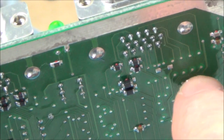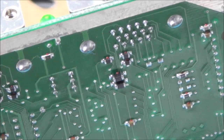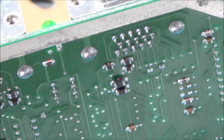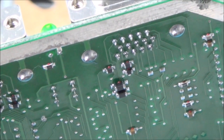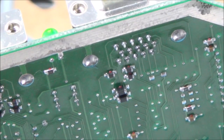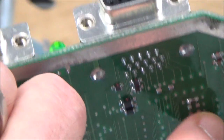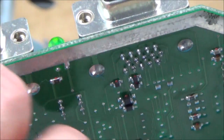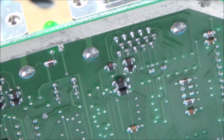Yeah, this one here. Now, when I took that off, I then tuned in, because I thought, well, hold on a minute, NTSC. I wonder what could be NTSC. So I just tuned in to United Arab Emirates and it came up, and it came up as NTSC, and I thought, oh, that's interesting. So then I popped the 0-ohm resistor back in its place, and this time it said PAL, but it's still tuned in.